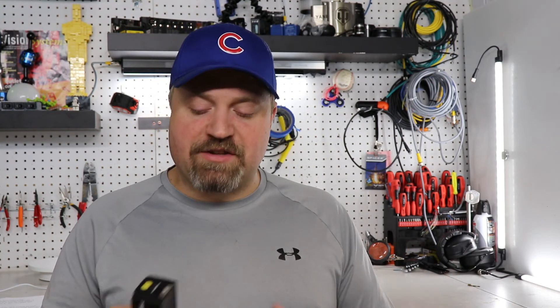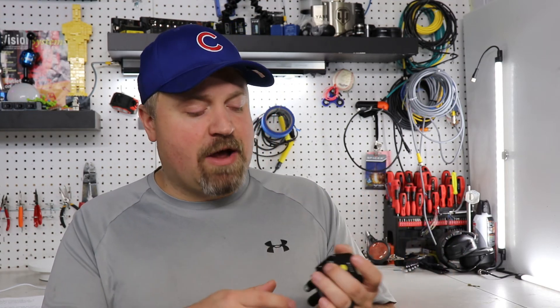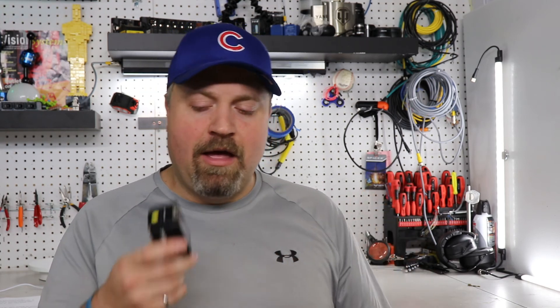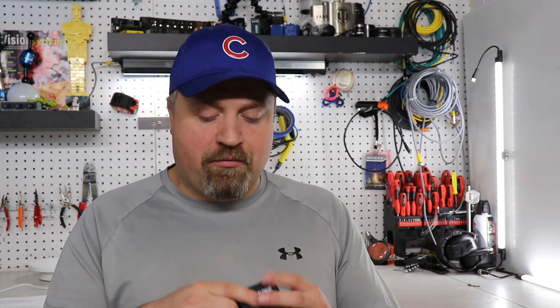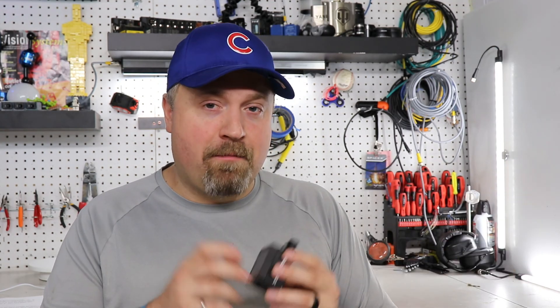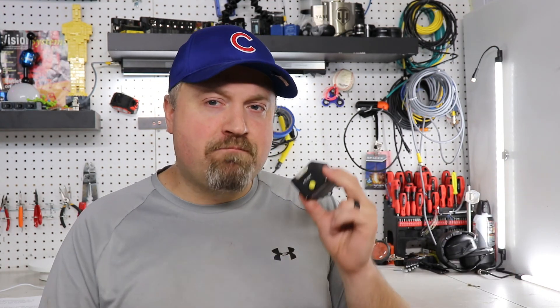So that's the review for the Smart VS. Overall I really like the features on this sensor — being able to input good and bad and letting the software decide the difference and set that algorithm is really unique, especially for setup time, being able to set up a whole part in 40 seconds of good and bad and select passing and failing. There's really not a lot of other smart pattern match vision sensors on the market that can do this. And with the promise of future protocols, connecting this to a PLC, and more selectable things like an ROI, higher gain, or a larger working distance with a different lens, there's a lot of promise for this sensor.